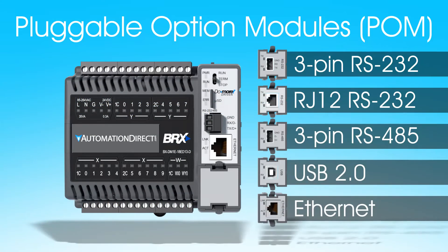One of my favorite features of this PLC is the CPU plug-in option modules. You can pop the blank faceplate out and replace it with different kinds of serial ports, a USB port, or even an Ethernet port. The Ethernet module is intended to give you an extra port for programming the Bricks PLC or talking to low data rate things like HMIs. It works on your existing 10 or 100 megabit Ethernet network, but the throughput is limited to 1 megabit per second. The nice thing is it frees up your primary Ethernet port for use in your application – you don't have to unplug it every time you want to update the ladder code.